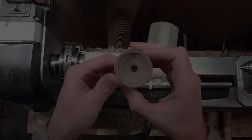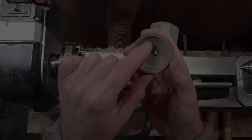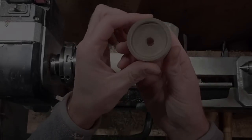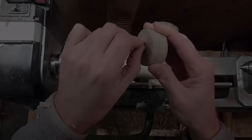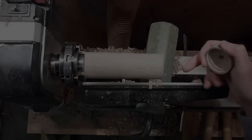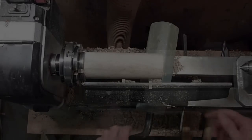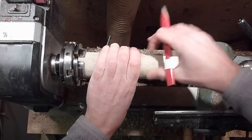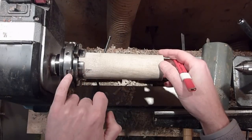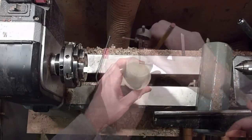So basically this is what we have. I've put a little lip in there to hold it up off the top, and I just cupped it out like a cone — it's not flat. I'll find out whether that affects the sound. I popped the hole all the way through. I'll make a tenon on here just like a box and put it back on. I need to get center on this and bore my holes down inside first. I'll mark number one on this piece before I pull it out so I know where the jaws go back in.